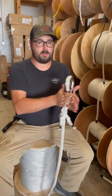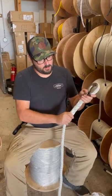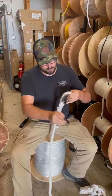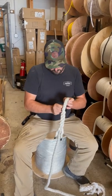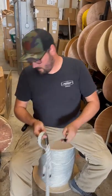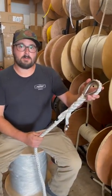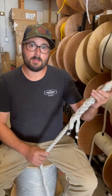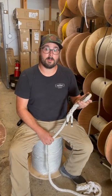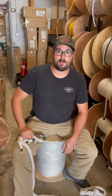If it looks a little lumpy, you can take it in your hands, give it a roll, and it'll clean it up. After that, take your tape off. There you have it — thimble eye splice, three-quarter nylon. Anybody could do this; it's just a matter of patience and doing it more than once. Because it's one of those things — practice makes perfect. Thanks again. Sea Gear Marine Supply, three-strand eye splice. Have a good day.